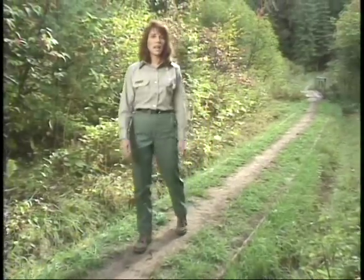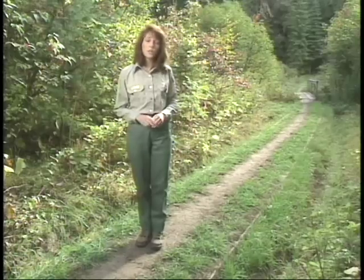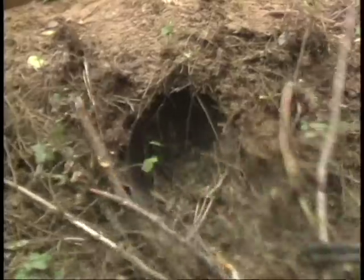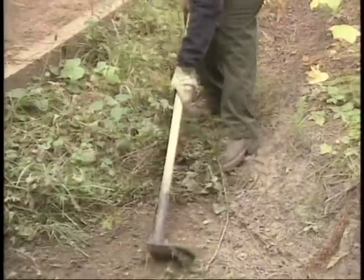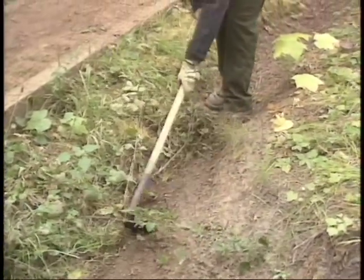While turnpikes can last 25 to 40 years, only with maintenance every 1 or 2 years will they realize their full life. Periodic clearing of the ditches is essential. Clean them out at least 12 inches deep or back to their original depth. If the vegetation surrounding a turnpike helps support it, do not disturb it.